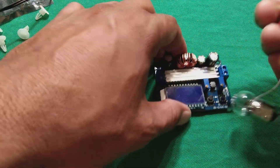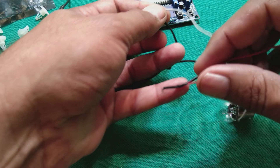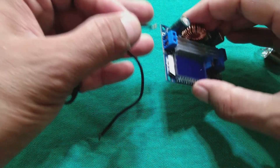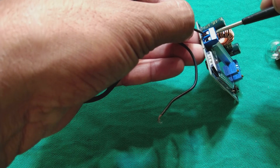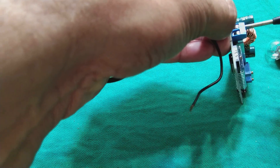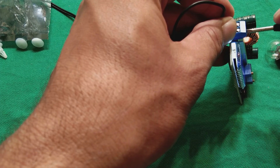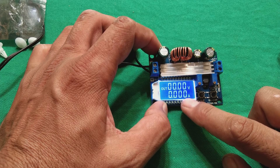I will connect one light, which is 10 watt, 12 volt. You can see this light is glowing with 12 volt and it is showing 12 volt. Now we will connect this power supply — positive and negative, take care. The upper hole is for positive and the lower hole is for negative. I will connect it accordingly. Take care because if you reverse the polarity it can damage the module. Now you can see the display has come on, showing some output.